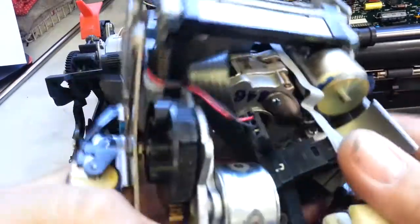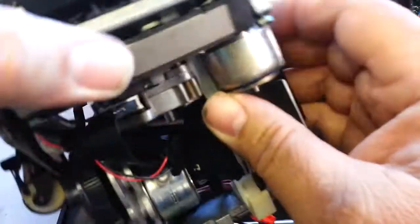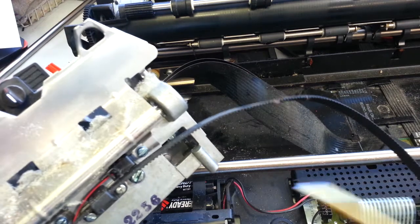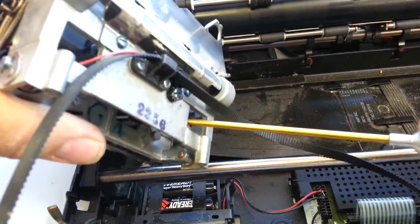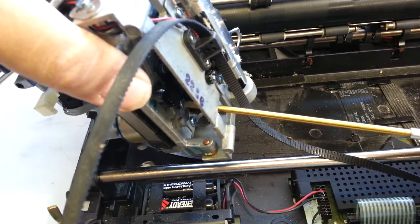Put the carrier in my hand like this. So what we're going to get to — I sure got a lot of cleaning to do on this machine — let's take this solenoid out right here. Here's the hammer solenoid, so it moves with the hammer, triggers this rocker. This piece moves in and out like this, it's mounted on here, a little tricky to get to but it can be done. Get the screwdriver that will fit in here properly. These are really long screws, there's two of them.